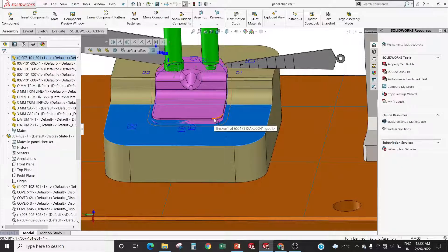Profile block is the main part of the panel checker to check the component. The component profile is offset at some standard values like 3mm, 5mm, and at some places 0mm. Generally Sika board is used for making the panel checker's profile block for reducing the weight of the panel checker.